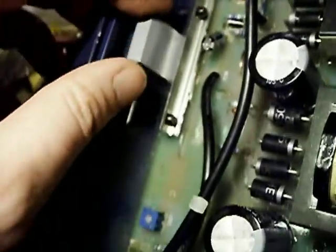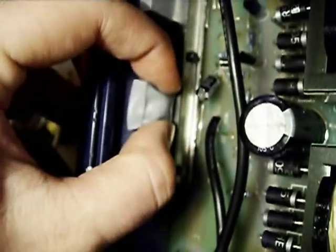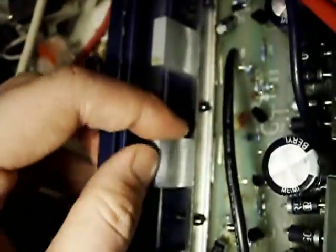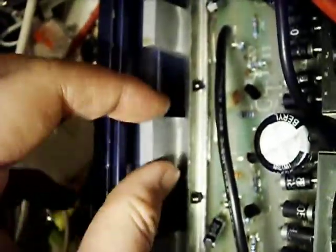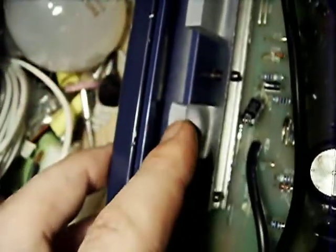And over here is the H bridge that actually creates the modified square wave. They are what appear to be TO-247 or some similar package devices, but without a heatsink tab, so these might be Super-247 or something like that, or they just trim the heatsink tab off, because they're held in place with this little metal bar against the case, and they've got these little silicone thermal pads or thermal sleeves for electrical isolation, because with most MOSFETs the tab is electrically live, as with most TO-202, TO-220, TO-247 package devices.